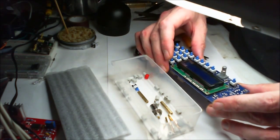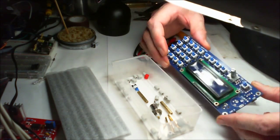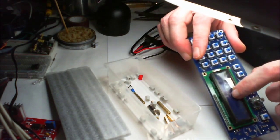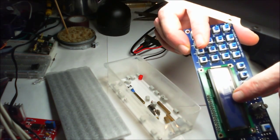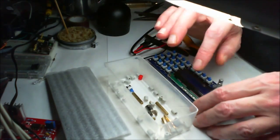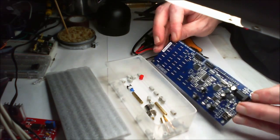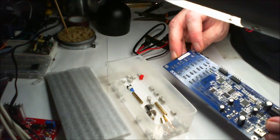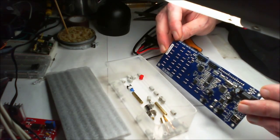Alright, so there we go, all that's soldered up. That all looks good, all in place how it's supposed to be. I'm not going to take this off just yet. You may not be able to see it, but there's just a little tiny bit of splat, a little squidge where the flux or part of the solder just splattered off. So it's always good to leave that on until you've finished your soldering. I'm just doing a quick visual double check, just to make sure I've not missed any of the pins on anything. Always good.